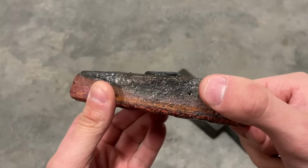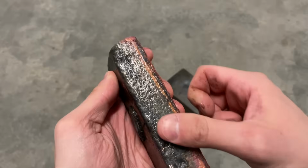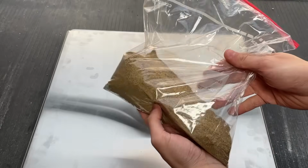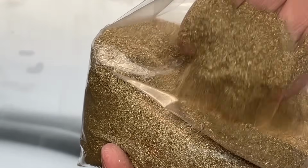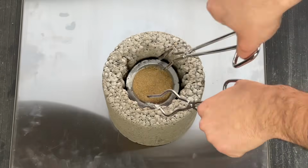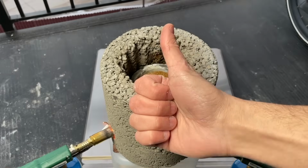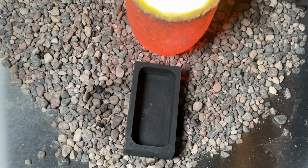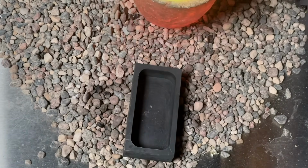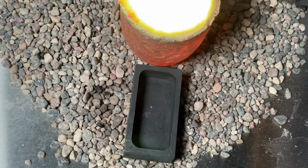This is where we want to emphasize a serious safety concern. Please listen carefully so you don't make the same mistake we did. After we smelted the copper, we decided to recycle all the brass shavings from our CNC machine operations. We filled up the crucible, took it over to the foundry and fired it all up. Everything was looking good to this point. But when we came to pour it into our graphite mold, we did not consider that we had just dunked it in water. And as it turns out, graphite can absorb a lot of water.